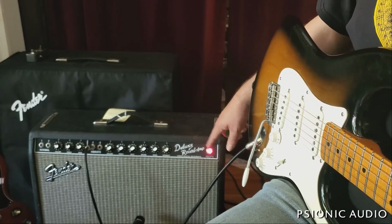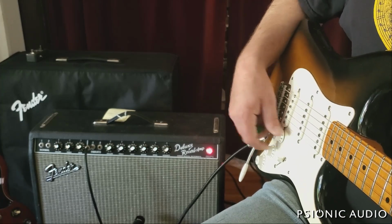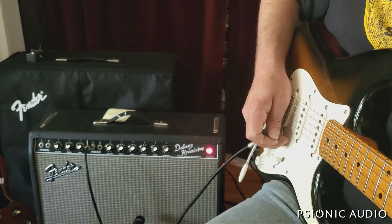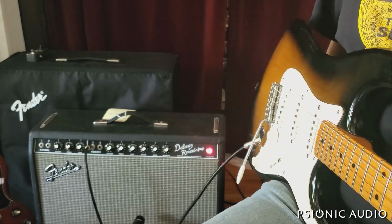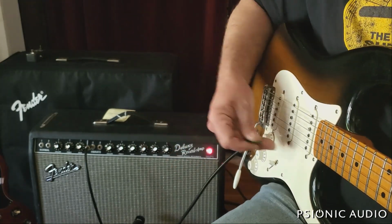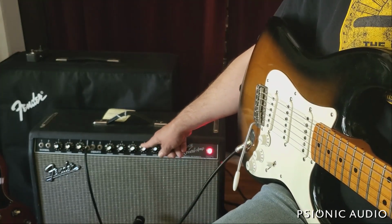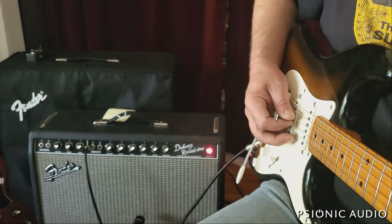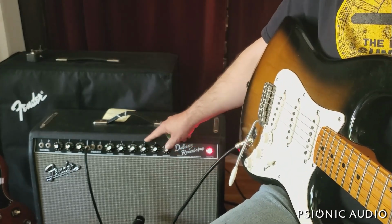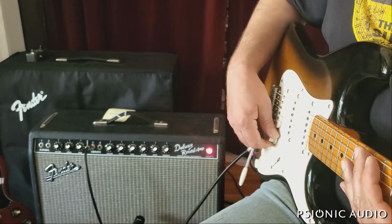All right, everything's back in place, and the reverb tank polarity was correct. Before I get into what the speaker really sounds like, I want to show why I need to change the reverb pot in this amp. With the reverb on 1.5, that's the amount of reverb, and it shuts off. Almost, doesn't completely shut off. So 1.5 is like 4 on most. So that pot needs to be changed out. And for some of this, I'll be turning the reverb off entirely.